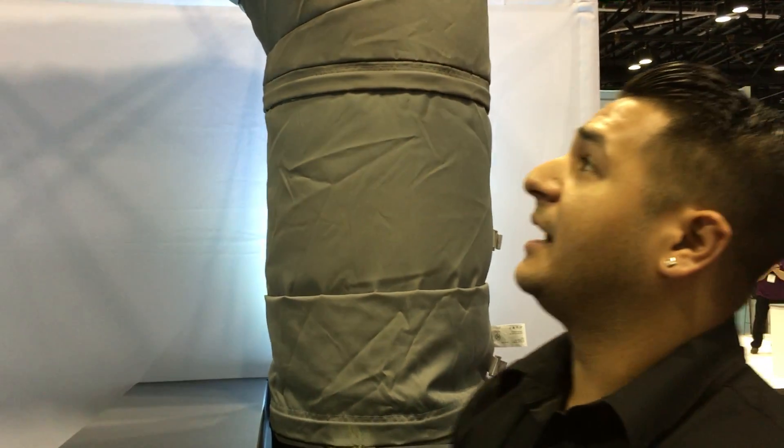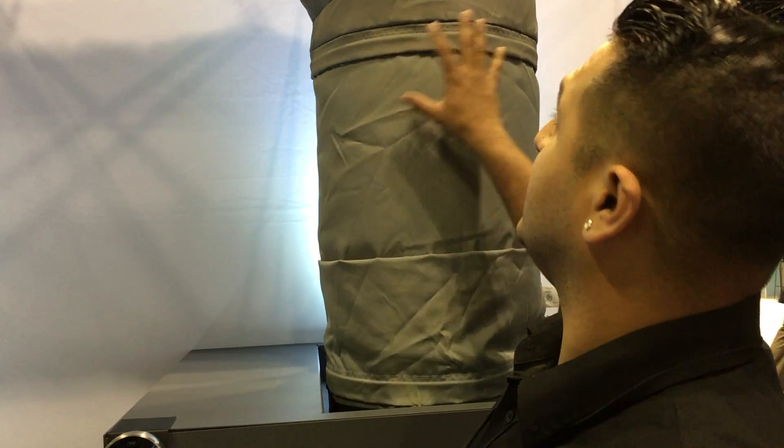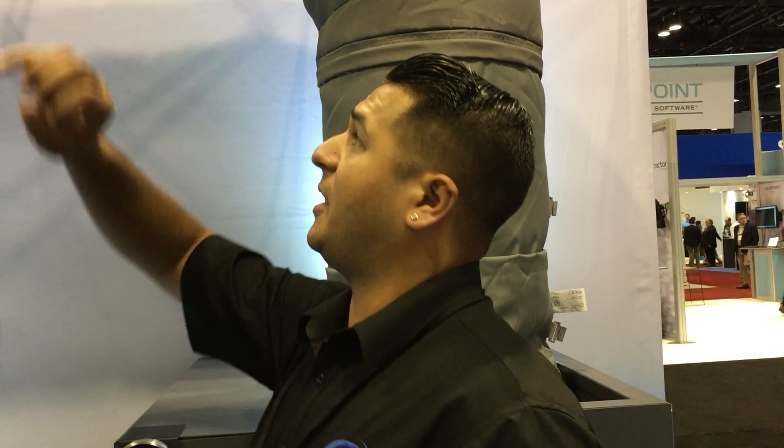These fabric ducts are always permeating, meaning there's no dirt or debris that's able to settle on it, because there's always a small amount — 2 CFM — coming out the top and the bottom.